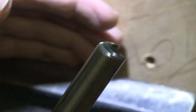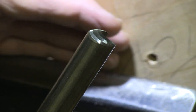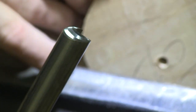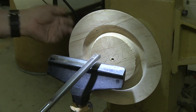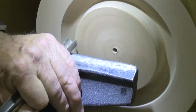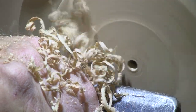This is good for this flat stuff. We're trying to shear the flat grain. That's a different job than we do when we're cutting the side of the bowl. And so in this case, when all the work we're doing is on that flat grain, this tool does a really nice job of leaving a good surface behind, if you can figure out how to make it work. And I'm still figuring out how to make it work, frankly.